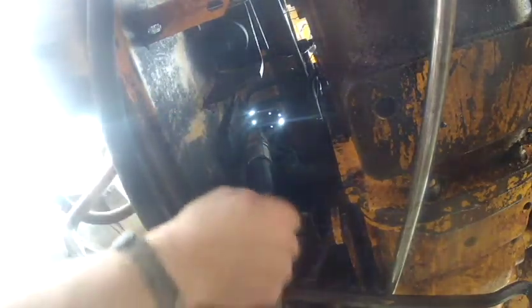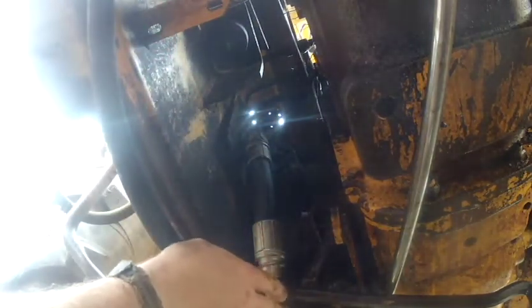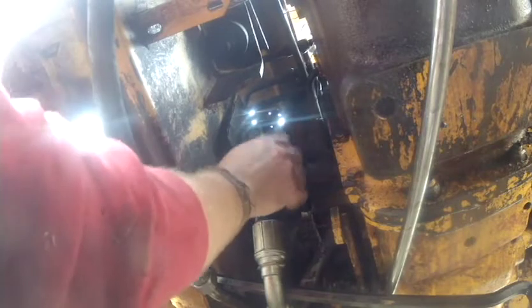So, I'm going to button this up, but a couple lessons. Before I put this hose on, I hand tightened that all the way, and I took it off, and I hand tightened that all the way, and made sure all the threads were going to work, okay? So I have a pretty good idea as I'm wrenching that up there how far this is going to go on here. It's got a lot of turning to do. So if you put this thing on here and you get like 2 little turns out of it and it stops, you're cross threading it.